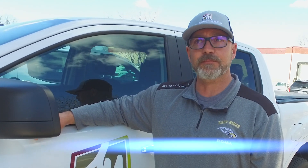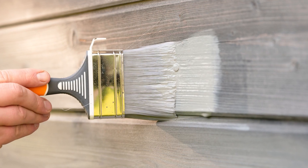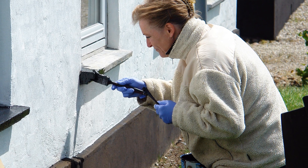How long does it take for paint to dry or cure? It's really weather dependent — that's why we look for the highs and lows to be over 50°F, so that we have at least a 12-hour period in between coats for everything to fully dry and cure so you can recoat.